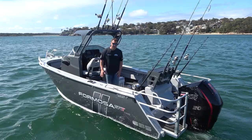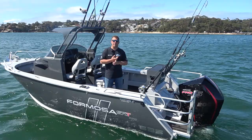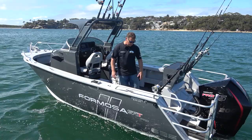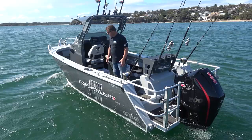This is a 635 Pro, and what the Pro does is give you the fully welded-in floor. It's a really nice way to finish your boat — quite an expensive option so you've got to be sure you want it, but if you've got the money to spend it puts that final finishing touch on. It also gives you the advantage of a self-draining deck: there's a scupper system on the transom, you undo the rope here, the scuppers are loose, and any water that comes on board drains straight out back into the ocean. The kill tank is fully plumbed in and hard plumbed out to the transom as well, so you can treat it like a floodable kill tank — it's nice and big and very easy to clean out.